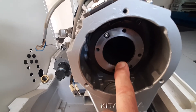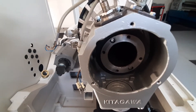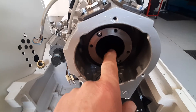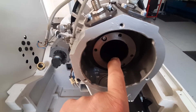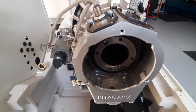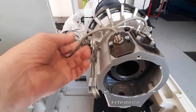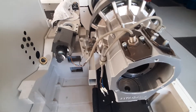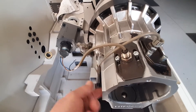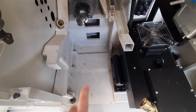This is the actuator tube - when I was talking about an actuator, this moves in and out. That threaded part of the shaft sticking out the other end is where the jaws activate from, so this is the drawer section. It's hydraulically driven with a couple of hydraulic lines up on the side coming in. There's still some wires to be connected into a small box on the side. These have all been cleaned - they were just a little bit oily and dusty so I gave those a good wash, same thing with the box on the side.